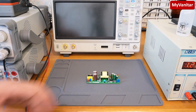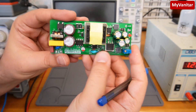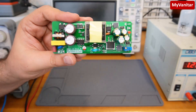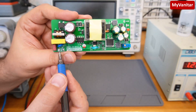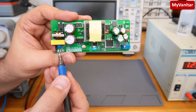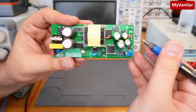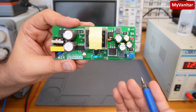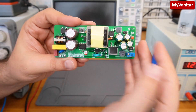Hi friends, welcome to project time. This time I decided to design this 24-watt dual-output flyback power supply. Here is the AC input, universal from 85 volts AC to 260 volts, and two outputs: 5 volts and 12 volts. The outputs are semi-regulated because I use the weighting method.